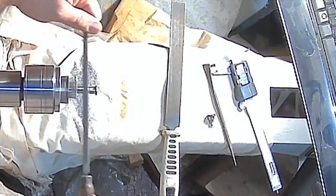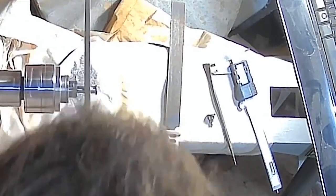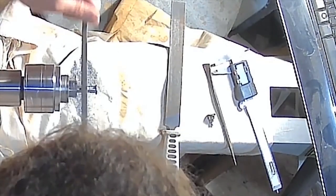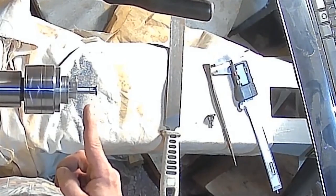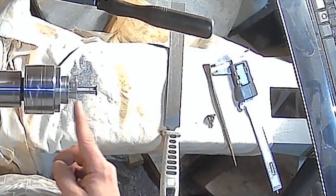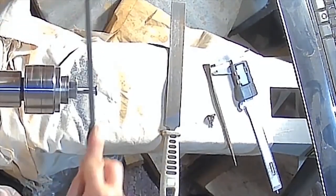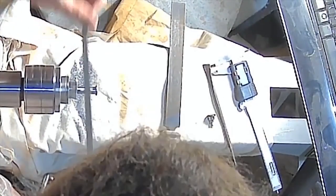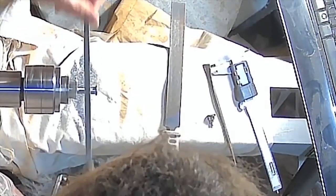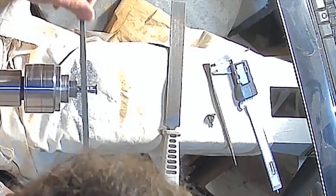Sorry if I'm quiet, but I really want to concentrate — I only have to do this once. I'm now going to move back towards the jaws because all of that section needs to be uniform, ready for me to tap. Using a bit of this lateral motion seeing as I've got a broader area to clear — bringing all of this area down instead of just concentrating on the width of the file. I'm not establishing two shoulders and risking binding the file. Binding would be unpleasant in this scenario.